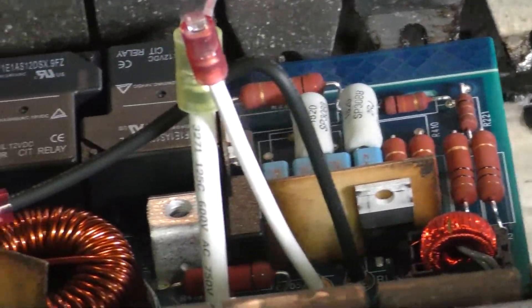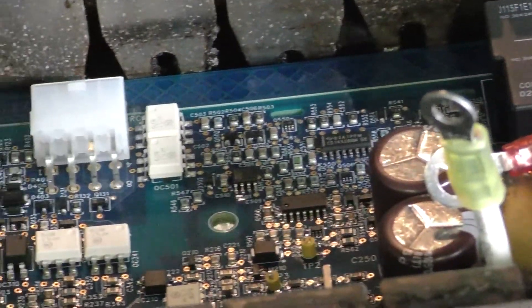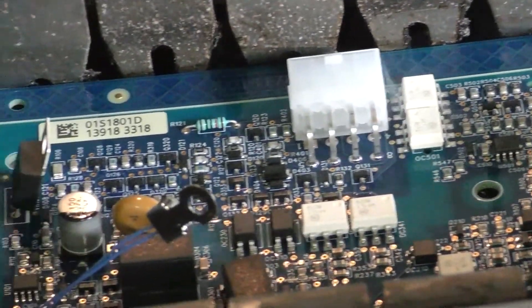The technology is limited when it comes to multiple parts on the bottom of the board with not enough area to solder. The other thing about wave soldering is that the 2,000-pound molten solder bath has to be maintained daily, and we pull a lot of what's called dross — the waste material from oxidation.